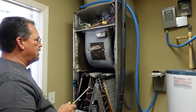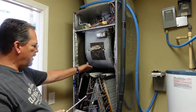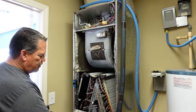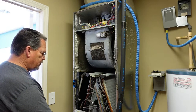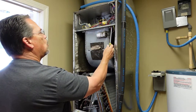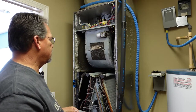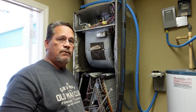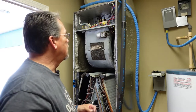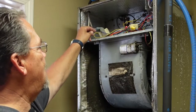What we've got to do on this UV light is figure out where we're having a mold and mildew issue the most. I can install this thing on the back panel, or I can drill a hole with my step-up bit and mount it right here, then mount all my wires straight up the panel and connect into the transformer's low voltage wires. This UV light operates off of 24 volts. You can also get these in 120 volt and wire it into your line voltage, but this particular model is a 24-volt install — it wires right into the 24 volts coming out of the transformer.